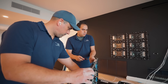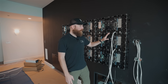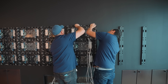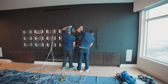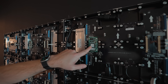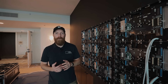We've come to our third column here in the system and this is the point at which it's time to start routing cables through into the cabinets. In the wiring diagram that you receive with the wall you purchased from Just Video Walls, you'll know exactly where the wires are supposed to go — all laid out for you, so you won't have to do any math. In the kit you receive, you'll also see all of the interconnects ready to go, color coded so you know exactly which cabinet they're supposed to go to and how they're supposed to connect together. At this stage we're just wiring those in through the front, including power at the bottom, so you can be ready to get those connected to each cabinet in a later step.